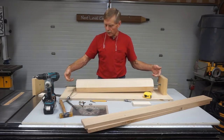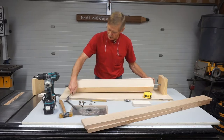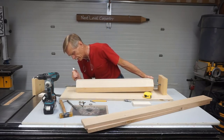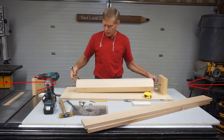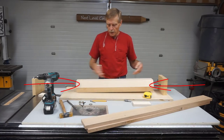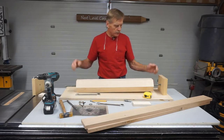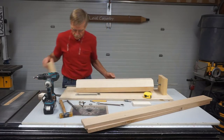And this is where the shoulder inside the ends of the tube takes effect, because I can tighten this down, pulling those hubs into that shoulder. If there was no shoulder there, I'd have to put something inside to keep the blank stable on the rod.